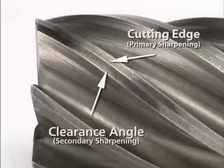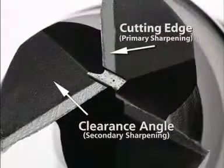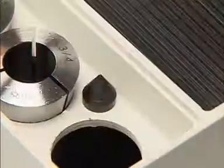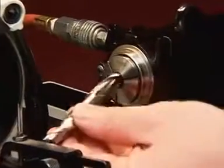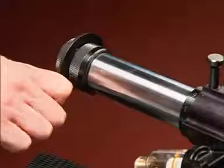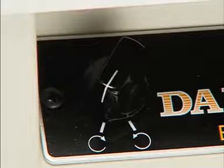Remember that four key areas can be sharpened: the primary cutting edge and the secondary clearance angle of each flute, and the primary cutting edge and the secondary clearance angle on the end. Before sharpening, insert into the air spindle the correct 5C collet for your endmill shank diameter. Place the endmill in the collet just before the beginning of the flutes and set the locking dog. Tighten using the draw tube. Also, ensure that the motor direction is correct. The wheel should turn clockwise to sharpen high-speed steel and cobalt endmills. It should turn counter-clockwise to sharpen carbide endmills.